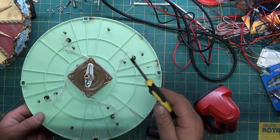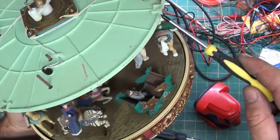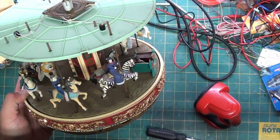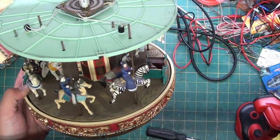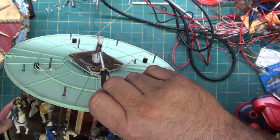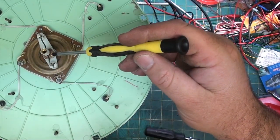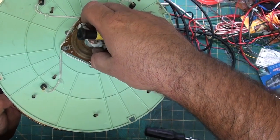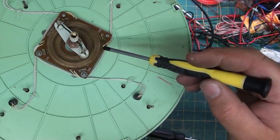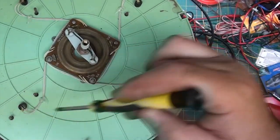And what I ended up doing was pop the tabs there and right there. There's four of them. Pried it open, used a light, stuck this small screwdriver, oops, let's try not to beat the heck out of this, all the way in to get it inside this slot and then put pressure on the slot, because all I was doing was spinning this rotor assembly with the two wires, which is just to make connection for the four lights.